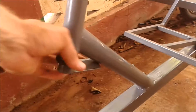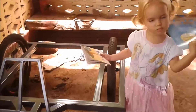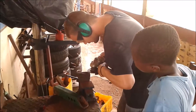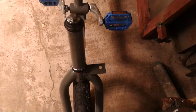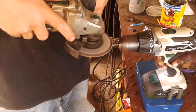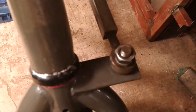Just getting ready to try to get the steering linkage figured out, and then start working on the gearing — first I gotta read a book. Here we are working on the steering linkage, and that's how you grind a 10-millimeter bolt for three-eighths to fit into that ball joint end.